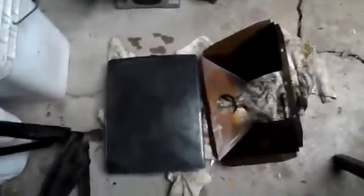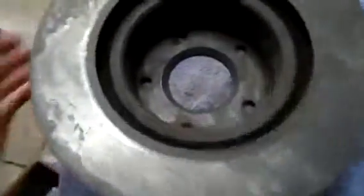Well, I'd say the brake rotor's been in the tank for about 4 hours or so. The sacrificial anodes have done their job. There's a nice layer of rust on the surfaces of it, but it can probably be used again actually. That top part's completely untouched, so I'll dry it out and put it in storage. Same with that one, that's got hardly anything on it. I'll keep those for the next big object I get. But anyway, here's the end result. And yes, it is the same rotor as in the start. In fact, you can even see score marks from the brake pads when this was still on its car.